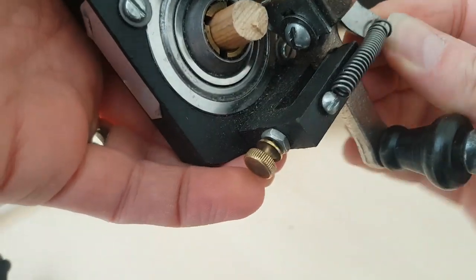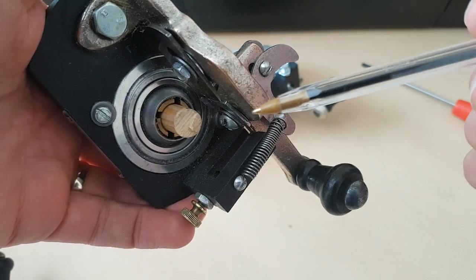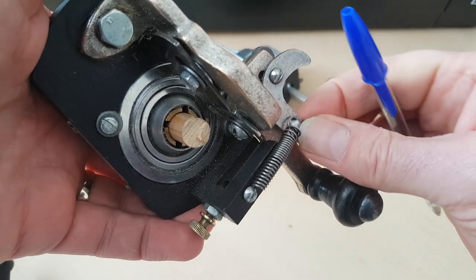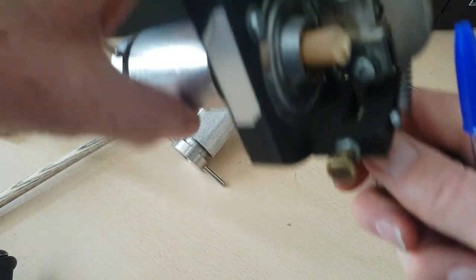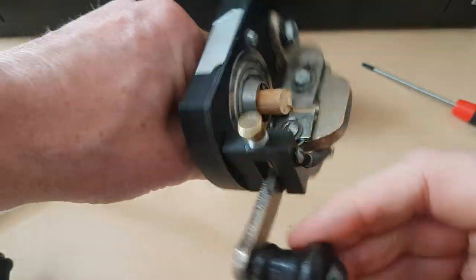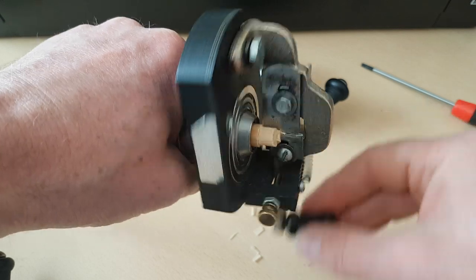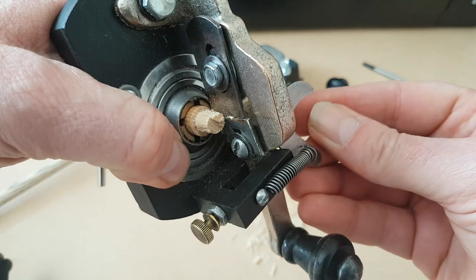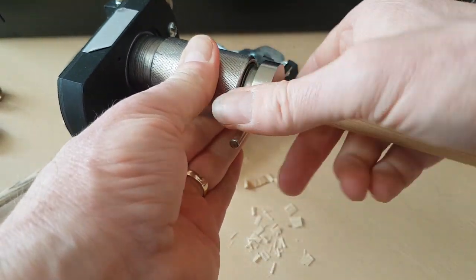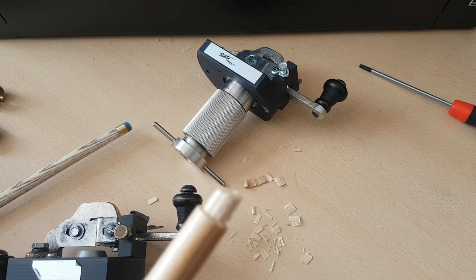You've got this locking mechanism. As you pull it in against the tension of that spring it brings the blade that way, so there's your locking mechanism. As I pull that up it's going to bring the blade in. Then you just turn it slowly whilst holding the base, and do it as slow as you can to give it a chance to cut. As long as you've got a decent bit of wood it will cut nice and clean. Once you've finished, unlock the blade, loosen the locking nut, and then take it out, and you should have a nice clean ferrule.